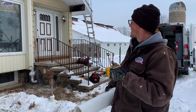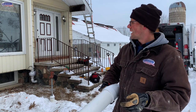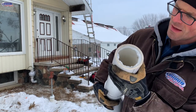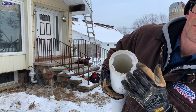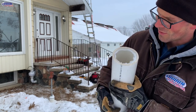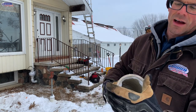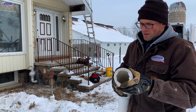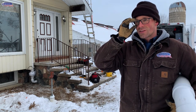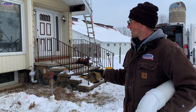One thing to mention: normally I would give the customer an option for heat cable to prevent freeze-ups and the condensate bypass. You can see that this started to freeze — we got maybe a half inch of ice right at the edge here, and it started to freeze back this way as well. If we would have continued cold temperatures or maybe more pipe on here, this obviously has a greater freeze potential. Here, Mike's on a budget and this house is probably going to be torn down in about 10 years — it would be a gas station or something. It's also commercial, so he didn't want to go too deep into it.